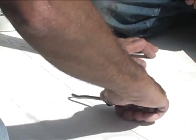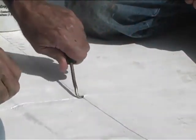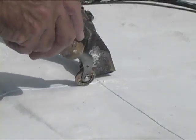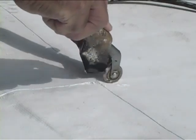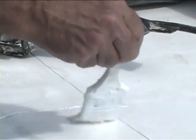At any T-joint, when the sheet overlays another weld, take a seam probe and penetrate the intersection. Brush in seaming adhesive. While applying heat, roll a narrow roller in the direction of the hole until the surfaces are sufficiently bonded. Finish by brushing seaming adhesive over the weld.